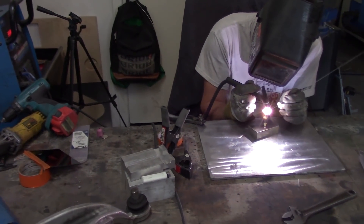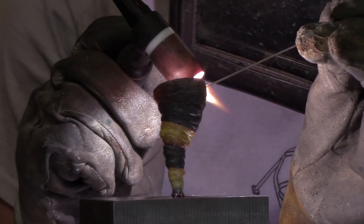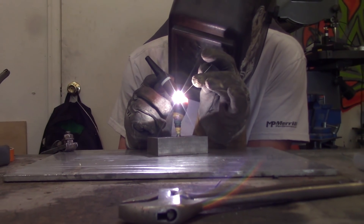The whole reason behind doing this video is that I love to do 3D welding art, but I was down to only a few hundred pounds of argon left in my cylinder. You never really want to run out of argon in the middle of a job because it potentially destroys whatever you're working on. So whenever I have a couple hundred pounds and a big job to do, I just find something to use the argon on. If I used a jumbo gas lens on this one it may have been a little less oxide forming, but I would not have a very big tornado at all. So I'm using a number eight gas lens instead of a jumbo — but if you really wanted to build one of these without the insane oxides, pretty much the only way is with a massive lens or an argon chamber.